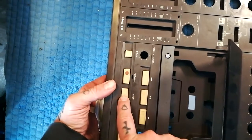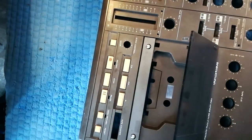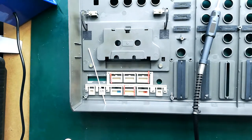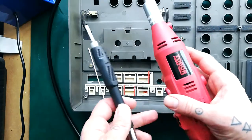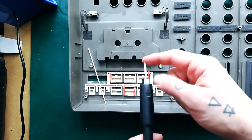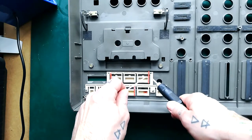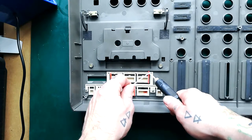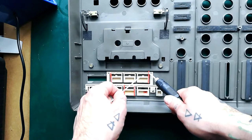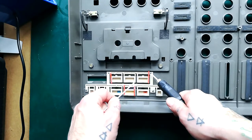That's left a nice little bit of tolerance around the glued-in button. Over at the other bench — I've demonstrated this before — I'm using a cheap hand drill. I've got a plastic rod in the hand drill, a thinner one that I'm feeding in from the side, and the friction between the three contact points gives me an effect a bit like metal welding. I'll have a kind of bubbly bit of plastic here.